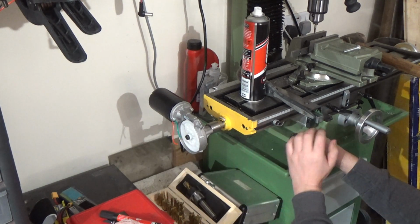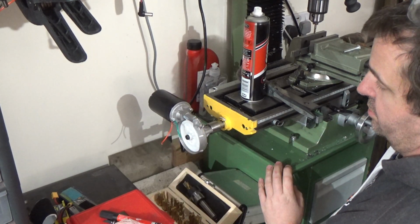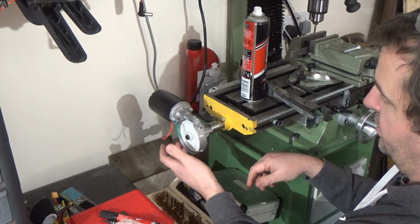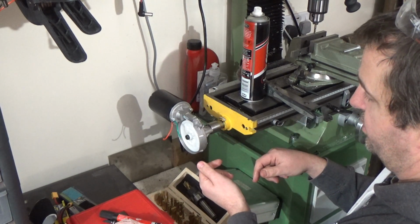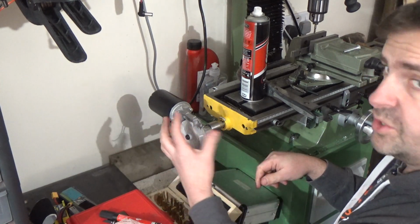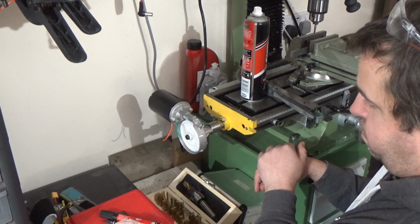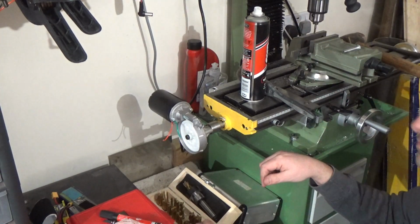Actually drilling the other way, I suppose, putting long bolts, bolting that onto there would possibly be the better answer. And then would that whole assembly go on afterwards? Potentially, because that would be a separate piece. Yeah, so that might be the way. I've got to drill 2 holes in there no matter what. It just depends if I put the bolts in that way, or weld some bosses, or a plate or something. But I'm thinking it is the twisting action. Just 2 good sized bosses going into that is going to be plenty. Like I say, I should be able to take it off and spin it around in any orientation if that does get in the way. But at the moment, that's the best option with what I've got.